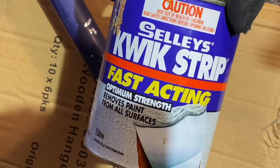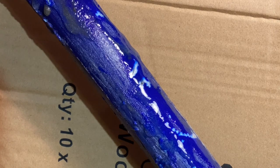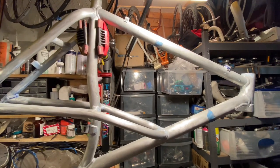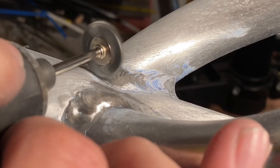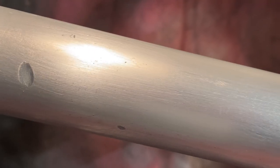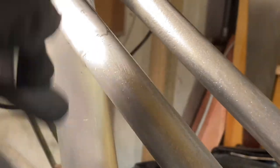Moving on to paint stripping now. I just use a paint stripper gel which you basically just brush on. You can get someone to media blast it if you want - there are lots of professionals that can do this. The way I do it is I scuff it up with sandpaper first, which seems to help a lot, then brush it on and let it activate for about 10-15 minutes - it softens up and then you can scrape it off. If you're going to be polishing, try not to use a paint scraper or razor blade on the last coat. For the little bits left over in the welds, I just use a dremel, and using scotch brite pads you can get along the welds pretty nicely.